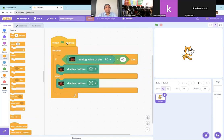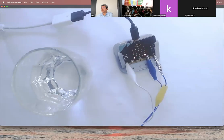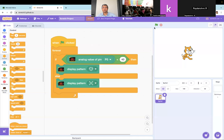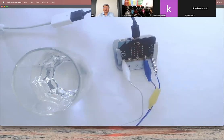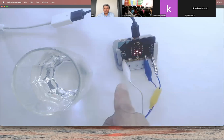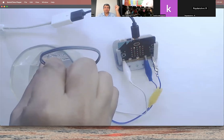I've written a very simple program: forever check the analog value of pin zero — the pin connected to my soil sensor — and continuously keep checking. If the value is less than 40, show a heart; if not, show a cross. We can test this now. When I've clicked the green flag I've got a cross. Like I said, the lights flash because of the camera but it's a proper cross. The sensors take around 30 seconds to stabilize, so don't be in a hurry — the first time you do it, wait around 30 seconds.